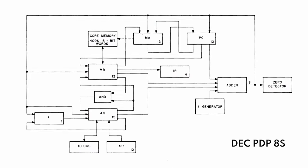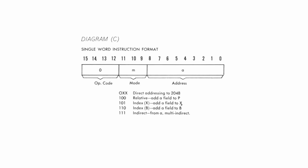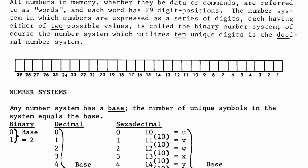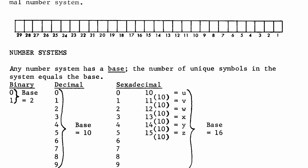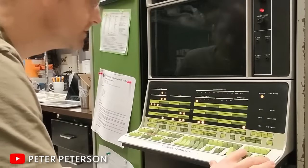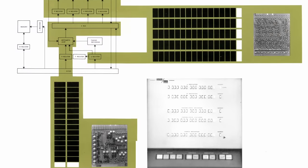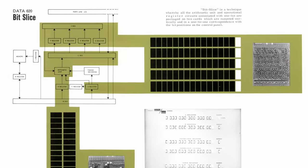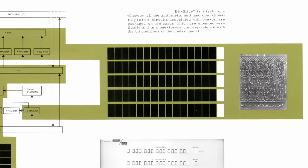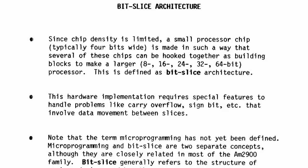Skipping ahead, we see the data word format. It is a 16-bit machine — the single word instruction format has a 4-bit opcode, 3 bits for the mode, and 9 bits for the address. With 16 bits available, you might expect a hexadecimal machine, but it's actually an octal machine. That's partly because octal was fairly common back in the day, but also this machine has a party piece up its sleeve. Bit slice — they explain that bit slice is a technique whereby all the arithmetic unit and operational register circuits associated with one bit are packaged on two cards, mounted vertically in a one-to-one correspondence with the bit positions on the control panel.